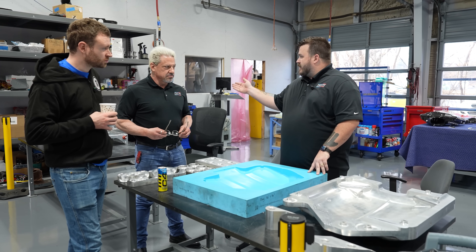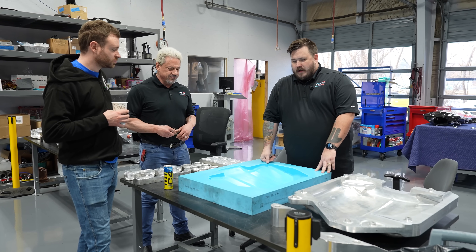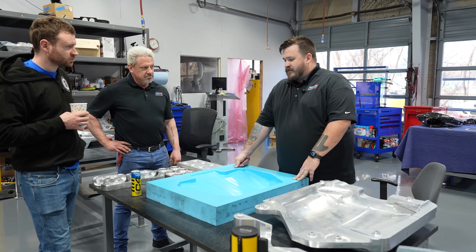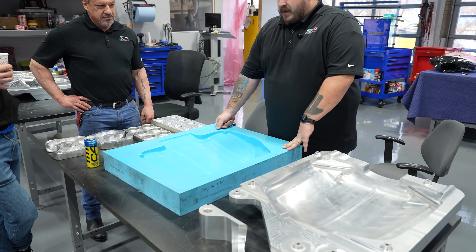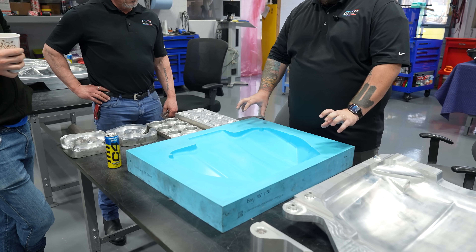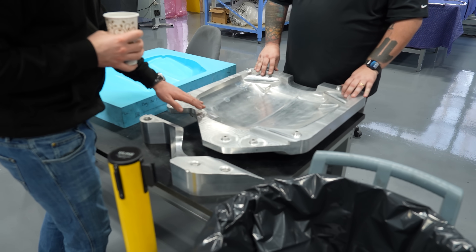I found a supplier here that actually had better options as far as thickness and sizes, and I went with them. But the problem is this toolboard is just more brittle than what Easy Composites sells, and that caused huge problems because our initial S65 molds were made out of this stuff. When I was still overseas using Easy Composites products, I could get 10 or 15 parts out of each tooling board mold, no issue. Here, we used the toolboard molds and got maybe three plenums out before they started falling apart. That put us really far behind.